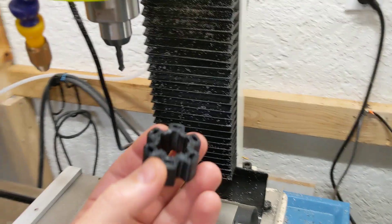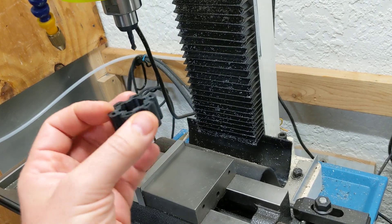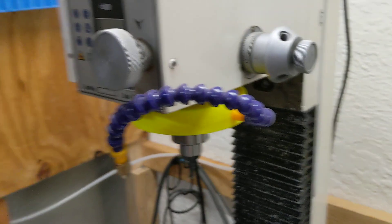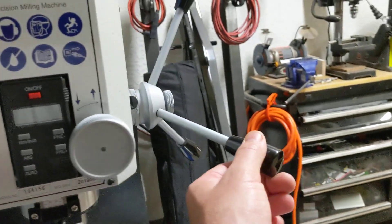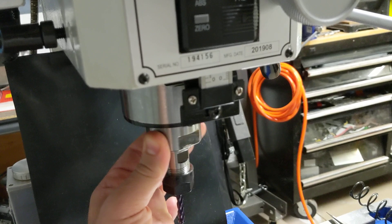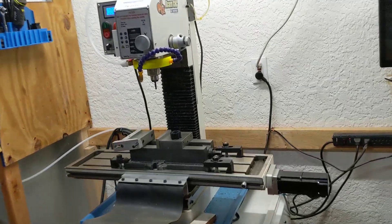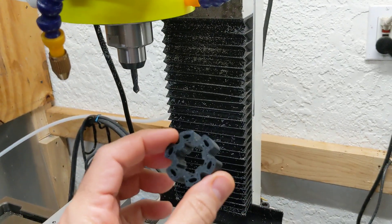That's all made possible by this little 3D printed bushing, and I'll put the link in the description. If you choose to disable the quill function — the drill press-like functionality — you can do that with a bushing like this. The bushing I put in this machine is different; I didn't jam it up completely because right now I want that drill press functionality, so it still has that clearance. But over here, nothing — you will not hear that on this one because of the close, snug-fitting bushing.